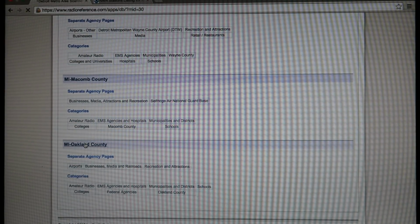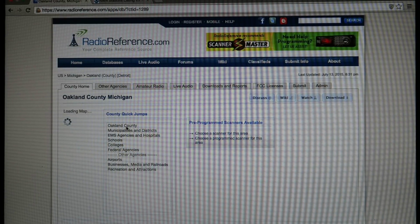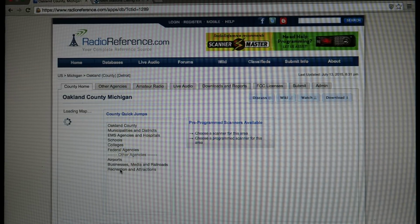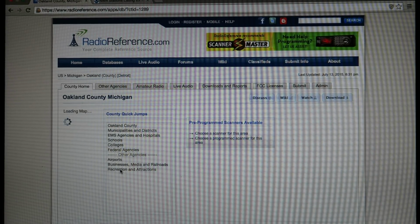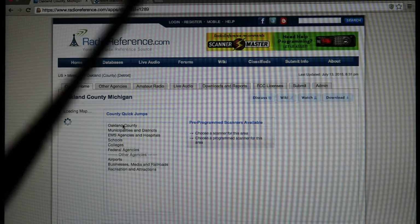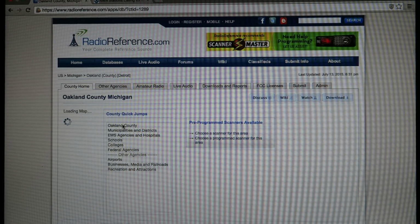I can go ahead and click Oakland County. And then you're going to get everything related to Oakland County. So we have municipalities and districts, EMS agencies, schools, colleges, federal agencies, airports, business, recreation. You can literally dial in to anybody that's using these frequencies to transmit and listen in. Now keep in mind you're going to have to be close enough to the repeater, and with the supplied antenna, that means you're going to have a fairly limited range.